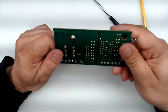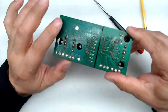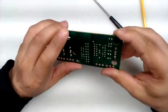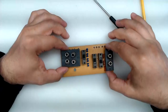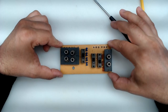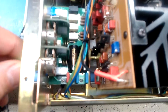To install this, I usually cut this board roughly in half, discard the PCB, then install new RCAs and the coupling switch separately, while cleaning the meter switches and reinstalling just that section. Now we're going to look at an actual unit to see how this whole thing looks. Here we have one of these selector assemblies already fitted into a B2. From the front, it looks the same as the original.